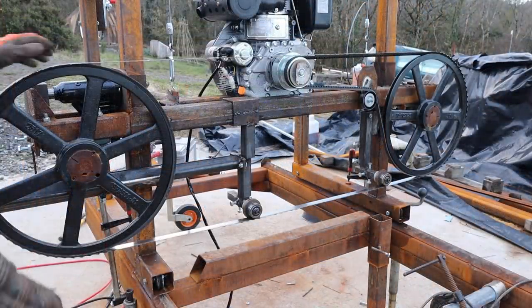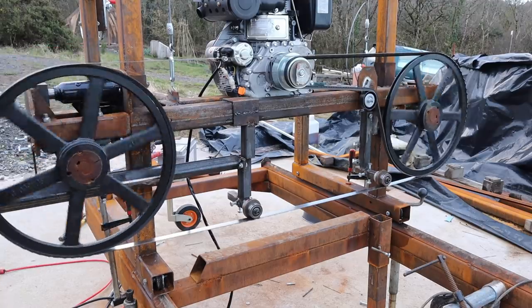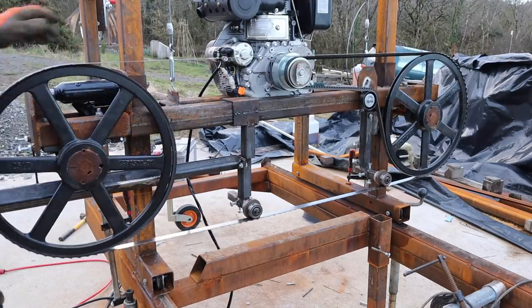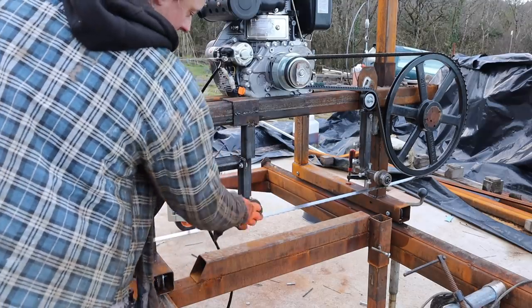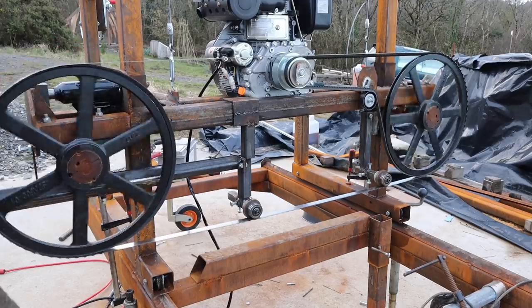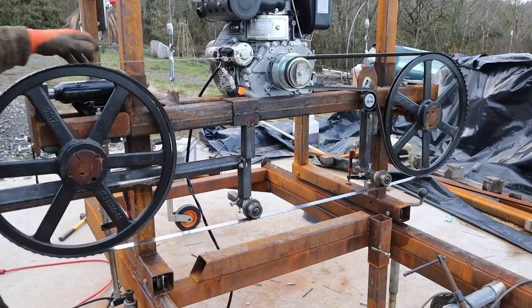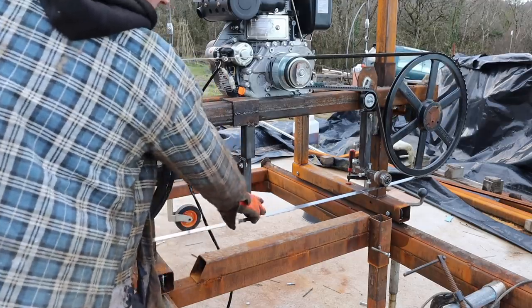So they work great. So good work there, Ades Workshop. Worked a treat. Now I did them quite a bit bigger than a lot of people do them. Sometimes they're quite a bit smaller than that, and the reason being is because they are going to be travelling very, very fast, and the bearings will last longer because I've done them a bit bigger than normal.